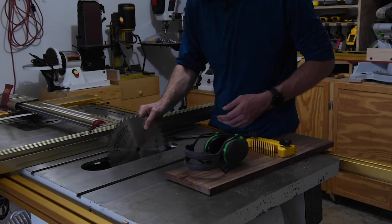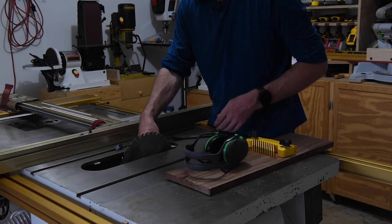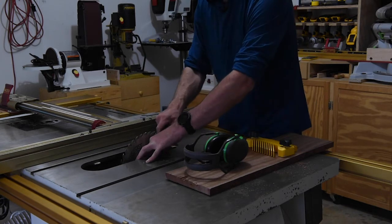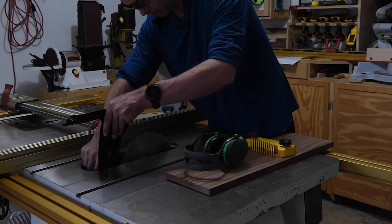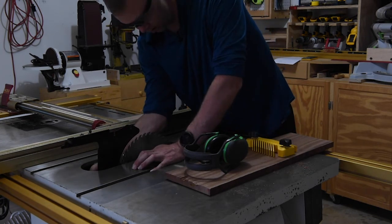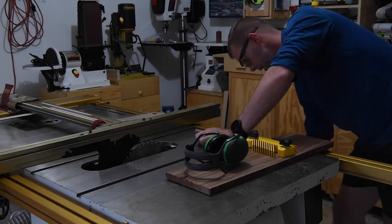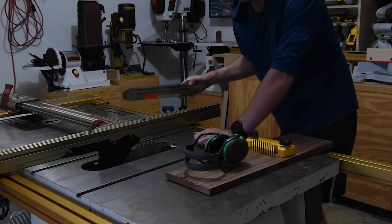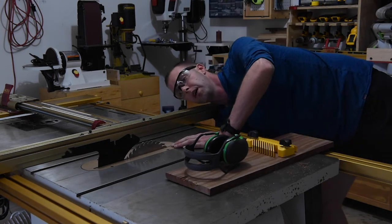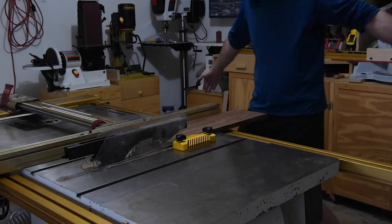Had to momentarily pause. Put a non-plywood blade on the saw, get the blade guards and everything back installed from using the crosscut sled, chop some of this Sapele up, square up the lumber. Once we get it squared, well, flattened on two sides since I don't have a good jointer, we're going to do the best we can. From there, we will hopefully do some miter work. All right, round three. Power, let there be power.